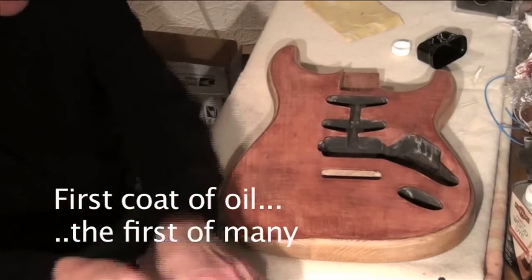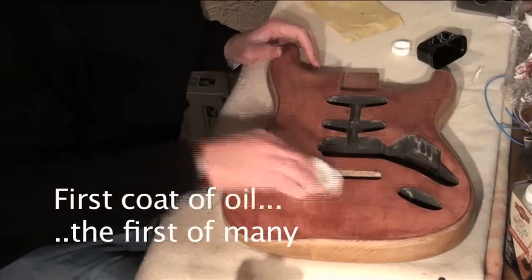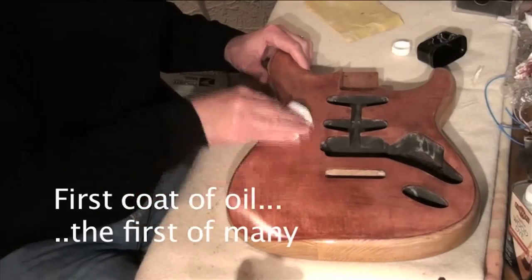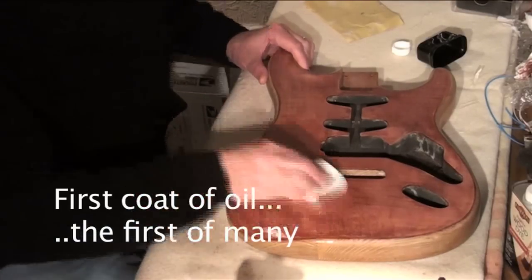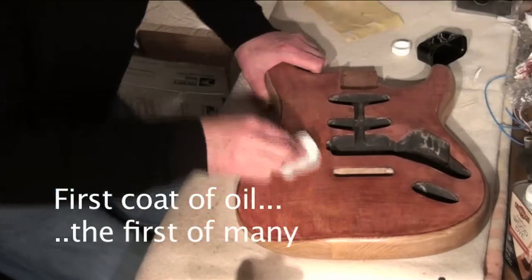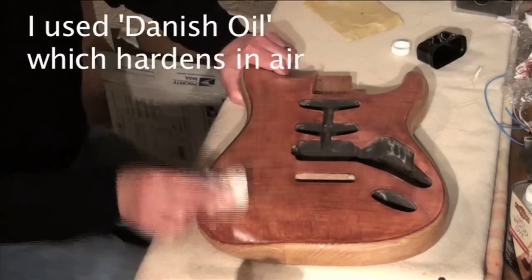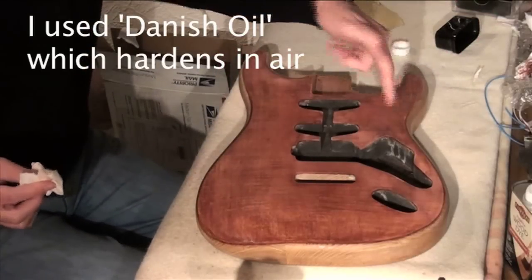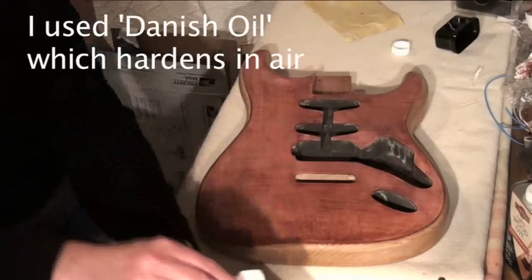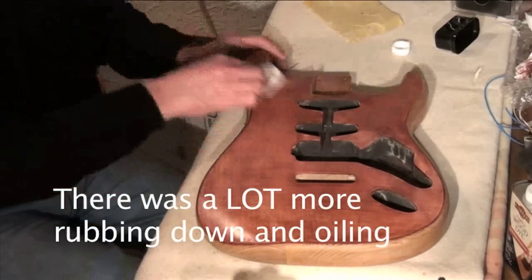I feel I've defined the line between the two woods pretty much as best I can. I'm now just using the really fine wet or dry paper to take out any scratches left by the 240 glass paper. I could have tested how it was going to come up by wetting it, but I've just done the final rubbing down so I really don't want to get water on it. I have been wetting it as I go along while I was staining, to get the most even finish. And all of a sudden — boys, we have flame! It's looking good, in fact it's looking so good I think I might change the shape of the scratch plate so you can see this bit of flame as well, because it's a nice piece of wood and it's taken quite a lot of effort to get it to this stage, so why not show it off.